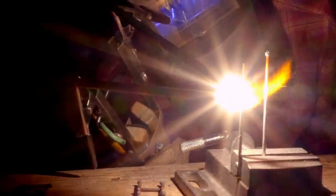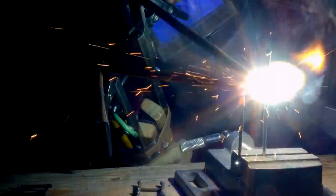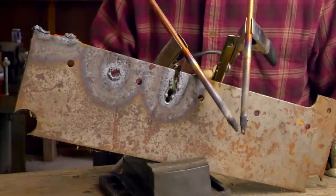This works great for heating both conductive and non-conductive materials, and I've also seen it work for brazing. An obvious disadvantage compared to an oxyacetylene torch is that you can't adjust the flame to be either oxygen or fuel rich — it just is what it is: superheated air. This can cause corrosion in certain materials like steel, but if you wanted to get fancy, you could add a line to blow a shielding gas into the arc, the same as with a MIG or TIG welder.